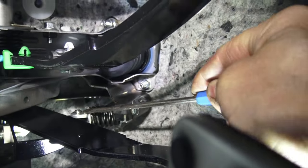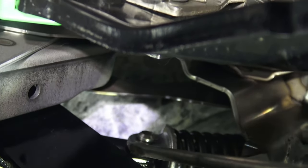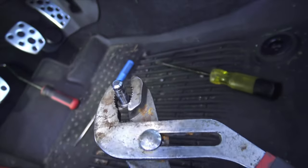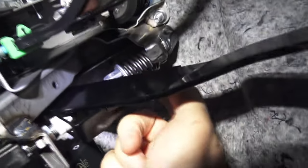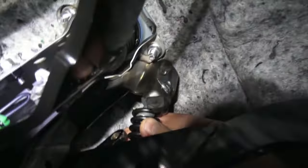The first thing you'll need is a small screwdriver. There's a little C-clip — best way to remove it is there's a little slot you can get your screwdriver into and lever it out. Once it gets loose it's going to go flying, so be ready for that. I'm using a pick tool to pull it out. Then using a pair of pliers to get the pin out the rest of the way. You do not want to lose this C-clip. Now that the pin is out, the spring can be removed. Using brute force, the spring is out.